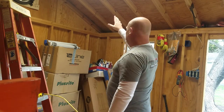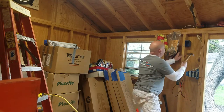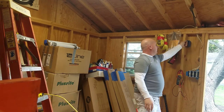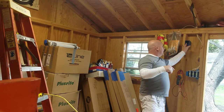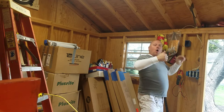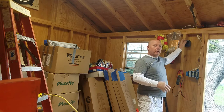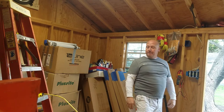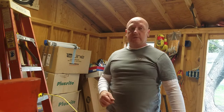I'm going to go ahead and start stapling some of this and getting it pulled into the box. I've already got the box mounted up here. That's where my three-way switch will go. I'm going to hit the load side on one side of the switch and leave the other side on the down part hot all the time to the line side of the thermostat. That way I can control it from here and yet the fan will come on when it's in the down position all by itself.